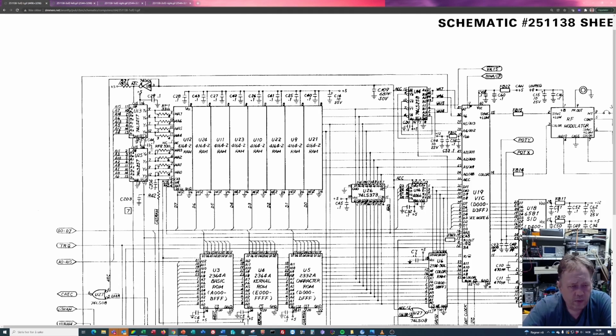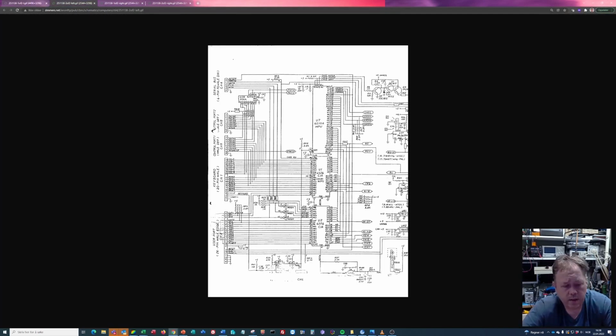But when we measured this out of the CPU. And the CPU, as we can see here, is connected first to this bus, and they have the parallel connections here, and out of this bus springs A0 to A15 that goes otherwise to the schematic here. So we have desoldered these chips, and these chips were never connected when we did the first test.